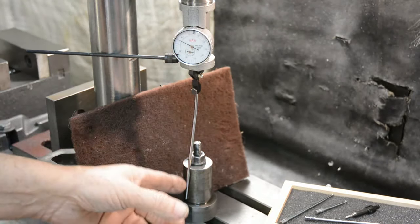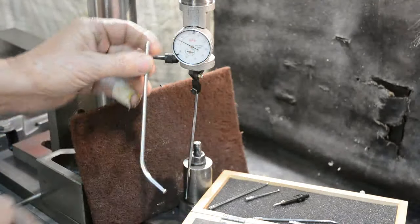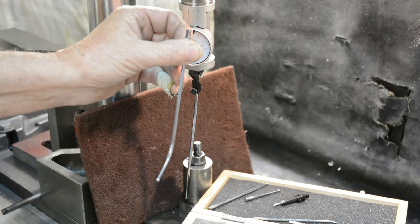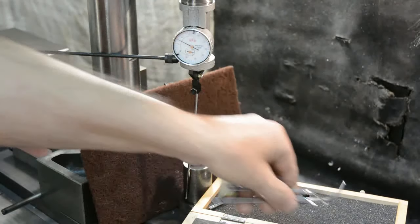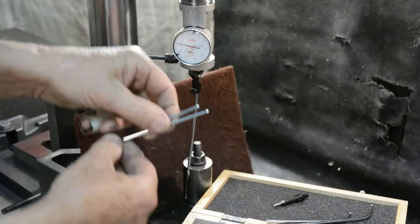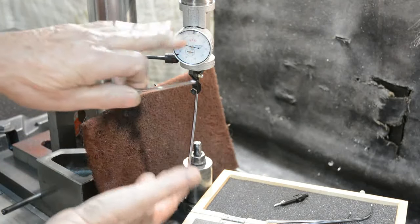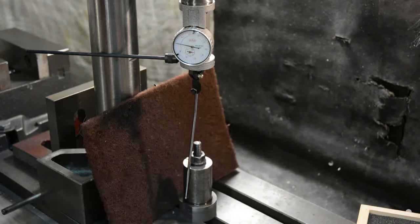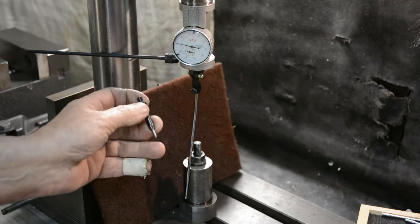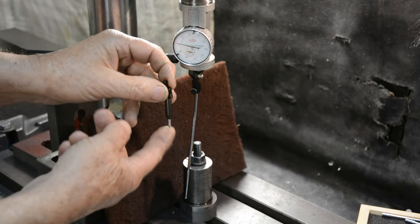With these, you can get different types of styli. For instance, this one with the bend would normally be used for centering on an internal hole, and there are several different sizes of those for different size holes. There are straight ones available of different lengths for different offsets and different distances. It's a very useful and quick way for aligning on a hole or a spigot. There's even a special stylus here, which you would put onto a center punch mark.